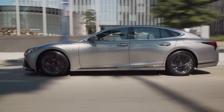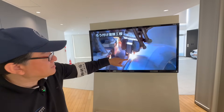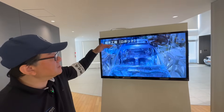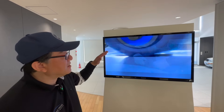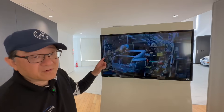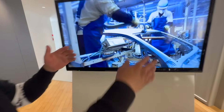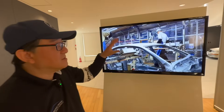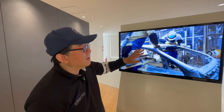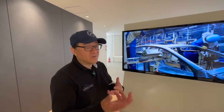Let me show you the film clip of brazing, where bronze is literally deposited and melted along the seam. Then the machine grinds it to smooth out the surface, but it can't take all the roughness out mechanically — so an actual Lexus production worker gets involved, doing further refinement by hand. This is a multiple-step process, using human hands and human experience with the takumi specialist, to ensure the roof and side panel are mated and fused perfectly.